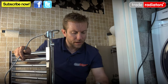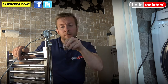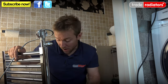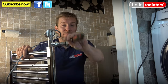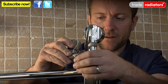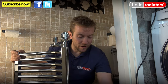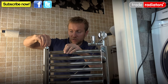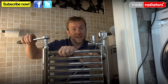What we also need to do is pop the insert on for the actual radiator. Sometimes the inserts need a hex key — fortunately because I do this all the time I've got one on board, though you might have to get one. It's slightly larger than 10mm which is usually what most hex key sets go up to. I'm just going to pop a straight valve on here, doing it up lightly for now because we're just going to use this so we know exactly what we're piping up to in a minute. Then all we need to do is pop the insert for a standard radiator fitting in this side. These are standard lock shields so it doesn't matter which way around the flow and return is — but do make sure you know which way around it is if you've got a non-universal radiator valve.